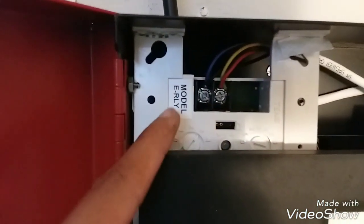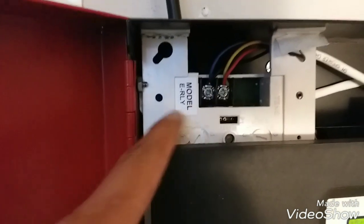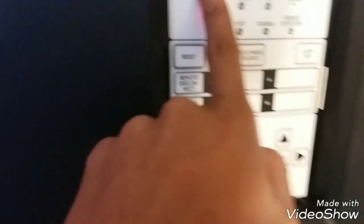The voice evac panel is connected to the RLY module — that's actually Will's, I bought it off eBay. As you can see on the display we have 'Alarm Active, Loop 1, Device 5, Bathroom Pull.' So let's go ahead and grab this flathead screwdriver and I'll go reset it while you watch the E70.